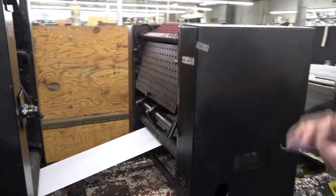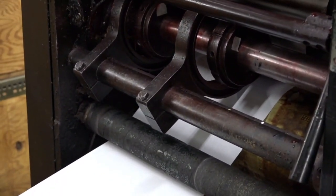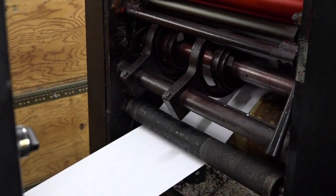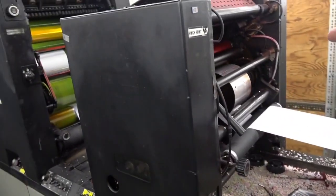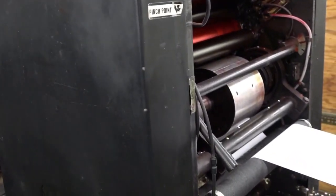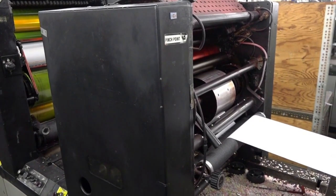This next unit is a numbering unit and a marginal unit. On the back we have cams — similar to those number-stamp machines used in grocery stores — and they'll count and advance. We do a similar thing: it runs through a cam and every time it turns around it clicks, so we can consecutive-number. On the front side of this unit we have a cylinder and we put sticky-back marginals on it so we can change those out every part and run office copy, customer copy, accounting copy — a lot of different variables for the customer for each part of a form.